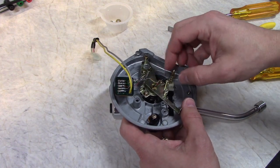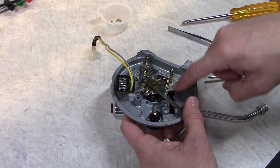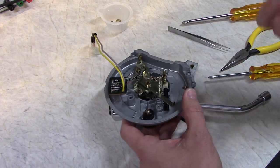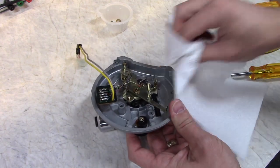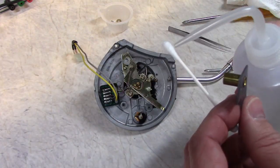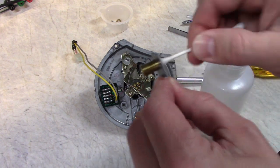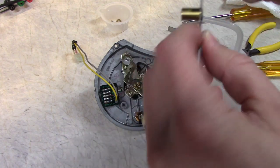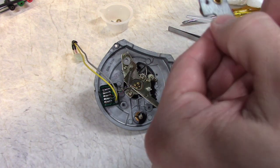There's the piston. You're not going to be able to get the piston any further than this. At this point you might be able to unscrew it — you can probably get this plastic piece to spin. But I'm not going to bother. Clean off the old incorrect-viscosity silicone oil — a little denatured alcohol dissolves it pretty well. Because I used the wrong thing I want to get it all out. If yours is dry you don't need to bother cleaning it up so much.